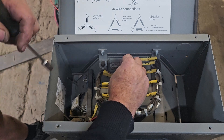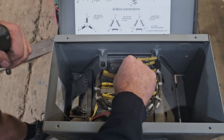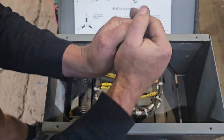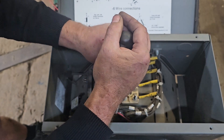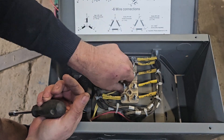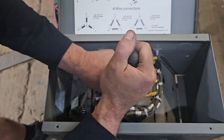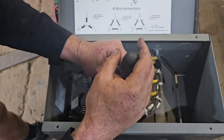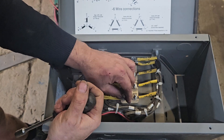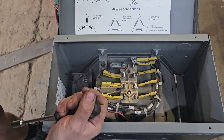Just as a matter of interest, the reason we chose the parallel zigzag and not the double delta: the double delta will still give us two phases, although they will all be 220V, but it won't be usable in a single-phase house. With this configuration, this generator will put out enough power to power a complete household — houses usually get a 60-amp supply from the municipality. In three-phase configuration you would have only had 220V at 40 amps available on one phase, and the rest would go to waste.